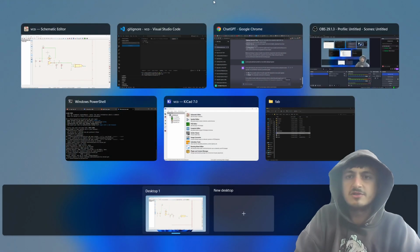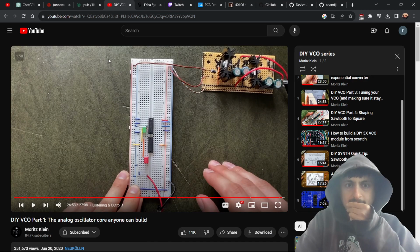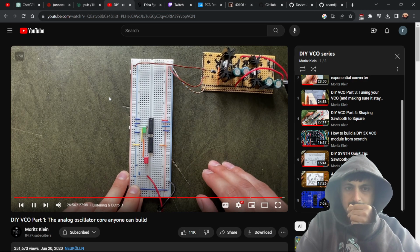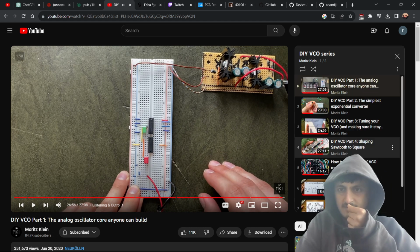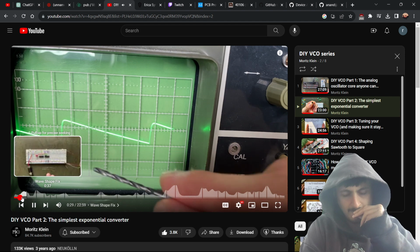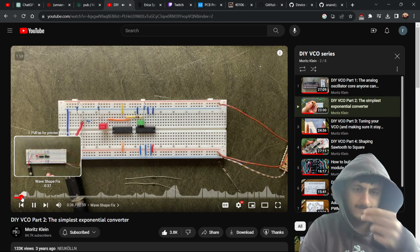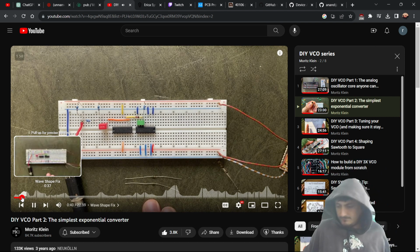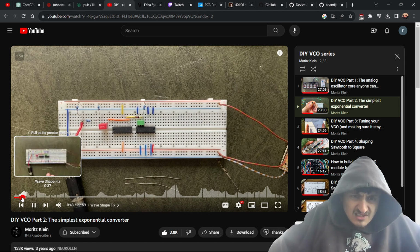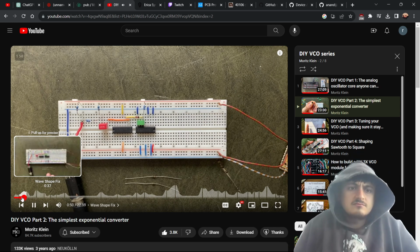Let's just look at episode 2. What else did we need? Because it's too high pitch right now. Well, the frequency is really a bit too high. But look at the waveform I picked up from after that voltage divider. The top part is weirdly rounded. This is not ideal because we don't want to put out a misshapen wave. To fix it, we'll just use two 10K resistors instead of 100Ks for our divider. I'm not going to go into detail on why that works because that's a topic for another video. Small hint though, we accidentally created a weird bandpass filter.